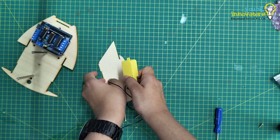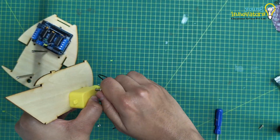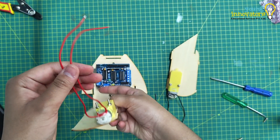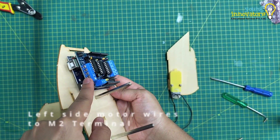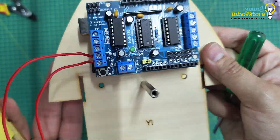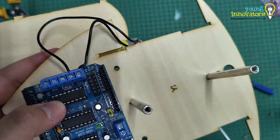Follow the alignment shown in the video. Next, mount the motors by screwing the DC BO motors onto their holders. Repeat this for all motors — left and right — to ensure they're secured in place. Now connect the motor wires to the motor shield. For the left motor, connect the wires to the M2 terminals, and for the right motor, connect the wires to the M3 terminals. You can connect the motors to any terminals like M1, M2, M3 or M4 — just make sure you reference the correct terminals in the programming.